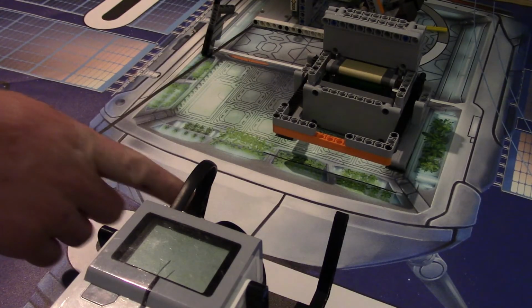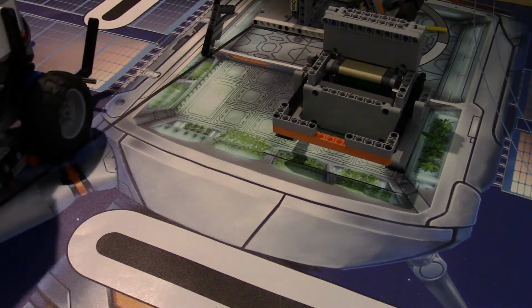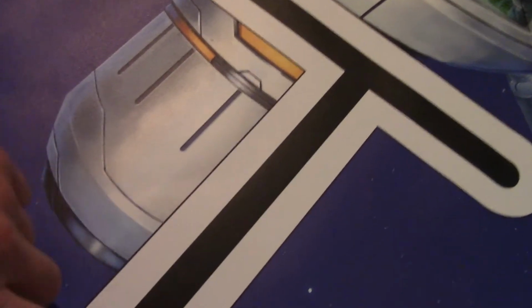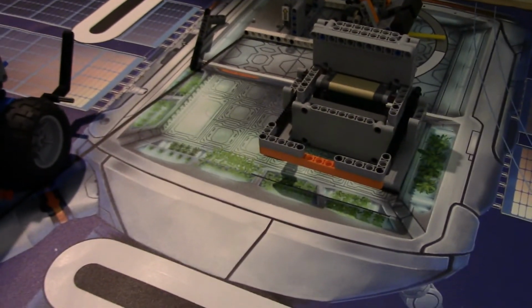With the two arms installed on the front of the robot, in addition to my first run, all the other missions that I will do, I can also do this food production mission. Simply, I will use a color sensor to detect this T-shaped black line in two places. The end of it here, and the beginning of it behind the camera. And actually, so you can see there, it's sort of T-shaped. So I'll use it to detect this first, then I'll have it turn and drive until it sees the end of this and drive only so far, and we'll take a look at that now.